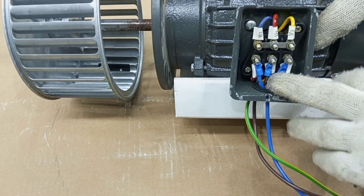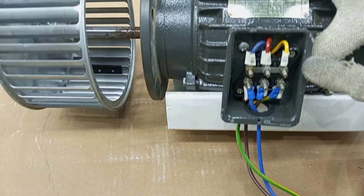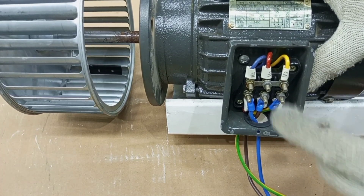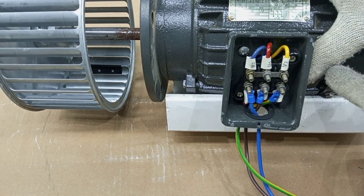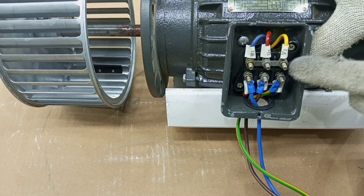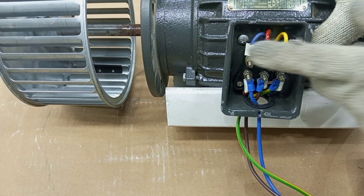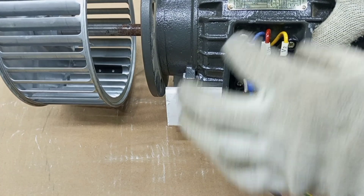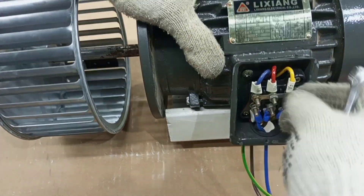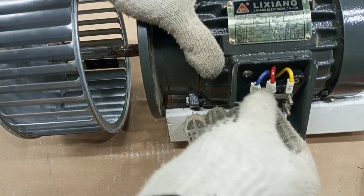As you can see, there are three lines, and three-phase motors need to be connected either in star configuration or delta configuration. So when we want to test or diagnose the motor, the first thing we do is remove each of these cables — whether it is connected in star or delta, we remove those connections. In this case, we are going to remove this star connection that bridges the ends of all the windings together so that each of the windings will now be free. So we remove these strips of metal that bridge the ends of the windings together.